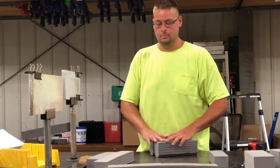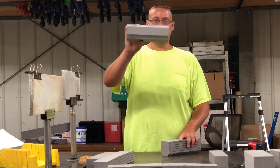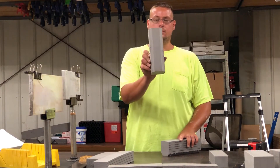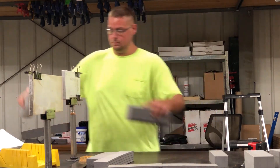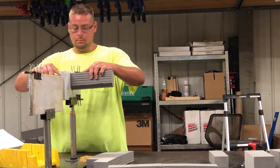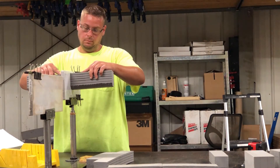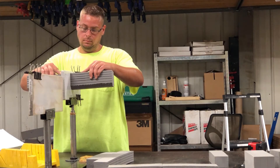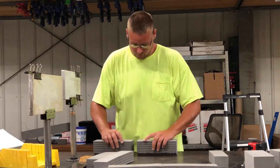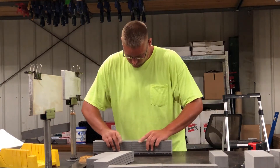If you have larger size material — something that's got 3 or 4-inch material — it'll take you longer. Same process, just longer on the heating iron. From here, you're going to hold on for probably a good 15-20 seconds, maybe 22, depending on the temperatures outside. Then same process again, applying them back together.